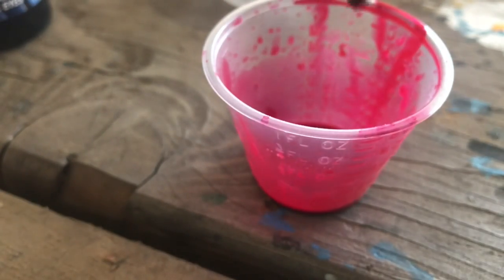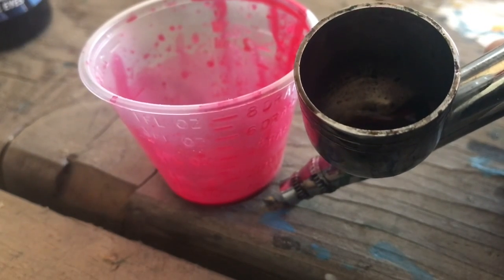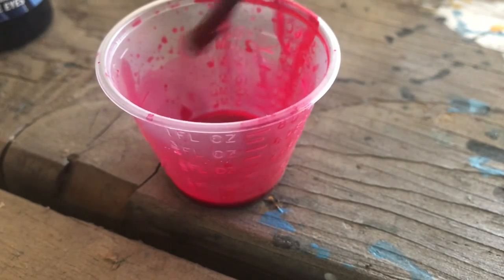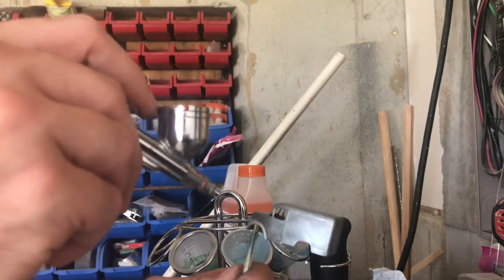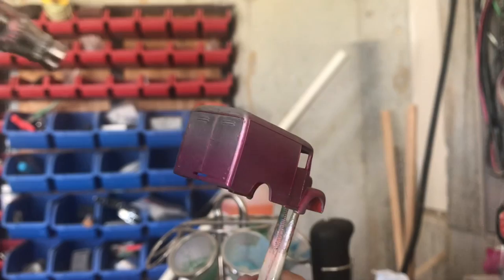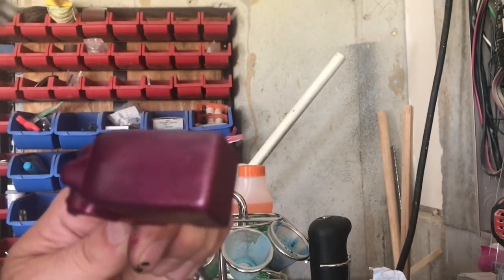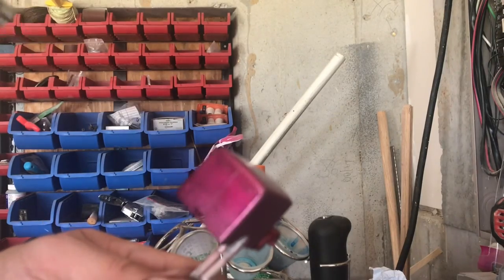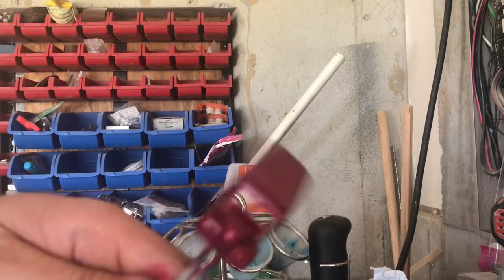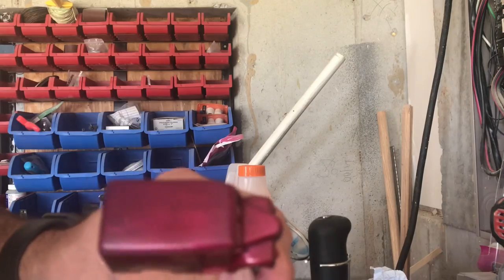In order to load my brush, I also use a pipette — something I can pull in and measure out a set amount. It also means that whatever I don't want to use for my initial spray, I can just squirt it back in the cup when I'm done. When I start spraying a casting, I want to make sure I get it really good and clean — I wipe it down with some alcohol to make sure my surface is prepped and ready for paint. I do not use any kind of primer. From my research, I don't think the Lesney factory used a primer when they painted them to begin with. They used an enamel paint that was hard and wore well, so I use the same enamel paints without a primer coat, and I've always gotten really good results.